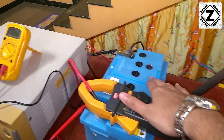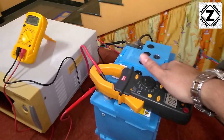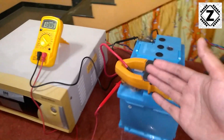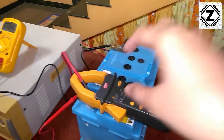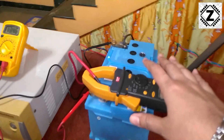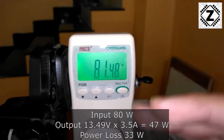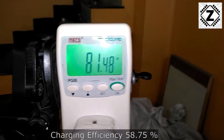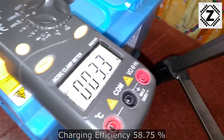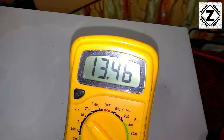Even though I connected a very small battery, the inverter was able to intelligently judge its needs and provide appropriate amperes. It's not the case that a large inverter forces maximum amps into whatever battery is connected — that makes me happy. The watt meter is now reading a very nice 81 watts, down a long way from those 180–190 watts. Even below 100 watts — just 81 watts. The charging amps are 3.2–3.4 amps and the voltage is almost touching 13.5 volts.